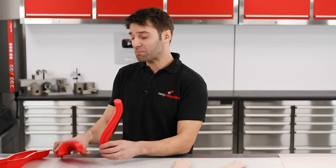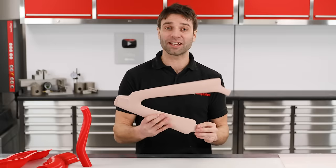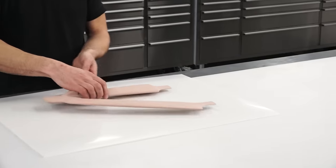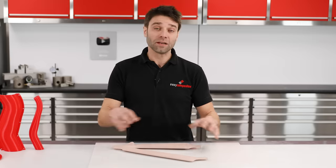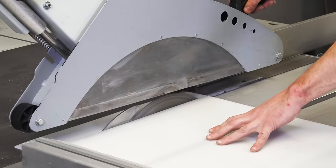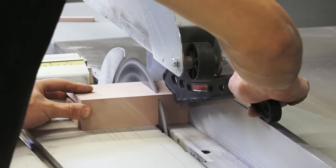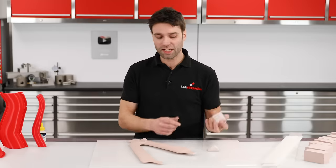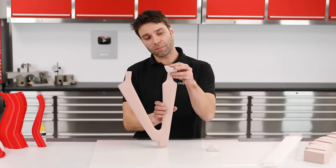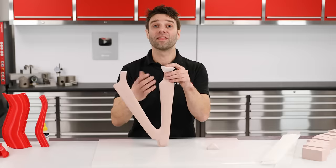If you haven't been able to 3D print your barriers, it's perfectly possible to make them very quickly and easily by hand — so we'll take a look at how that's done on this wishbone. For the baseboard and barriers I'm going to be using polypropylene, which I find particularly easy to work with for silicone moulds. I'm cutting these down on the panel saw and at the same time cutting down an offcut of polyurethane model board to create some supporting blocks. I've also cut these pyramid features, which I'm going to bond onto the end of the pattern to form a funnel, making pouring the metal into this very small cavity that bit easier.